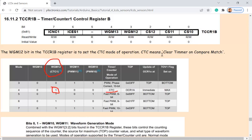But it has other types of interrupts. For example, it's not based on the timer, it's based on a different signal from the outside of the chip, which also makes sense, right? It's not based on a timer, but on something happening in the world, like an emergency signal or something, to trigger the interrupt. So I don't want to keep running this loop anymore because something very important happens. I have to do that one as a higher priority.